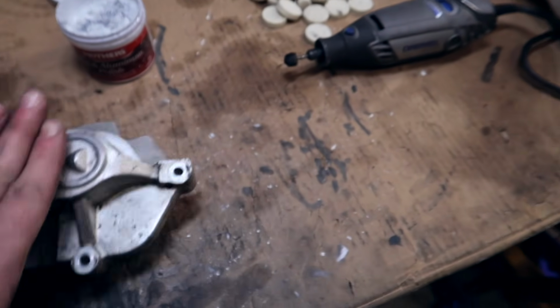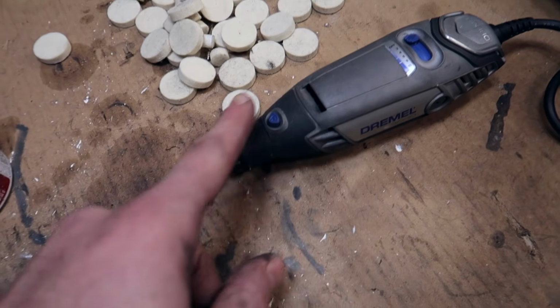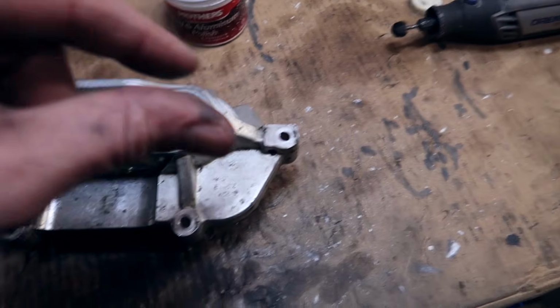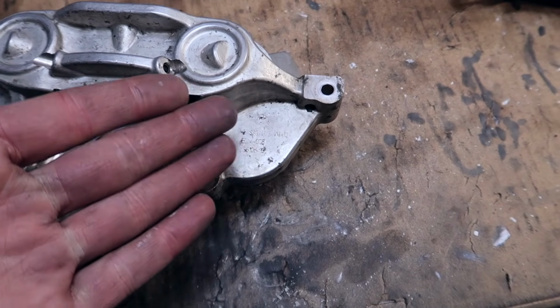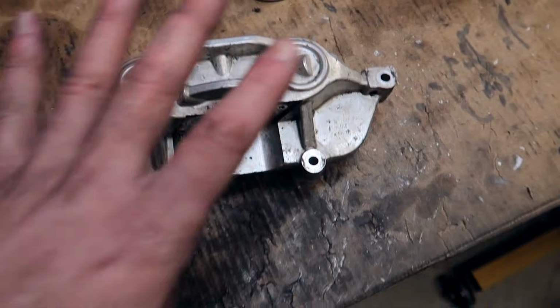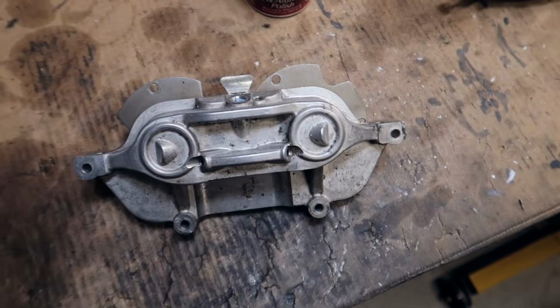One thing, key note, do not press down on the aluminum all that hard. Pretty much just use the weight of the actual Dremel itself. Do not press on it, do not push it in. If you push too hard, the polish is just going to burn up, and it's actually going to smear rather than polish anything. In essence, those are the key points, but I will guide you through this as we're doing this together. So, put your safety glasses on, and let's get to it.